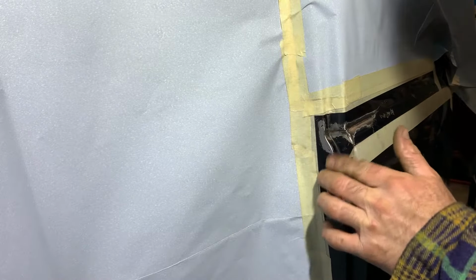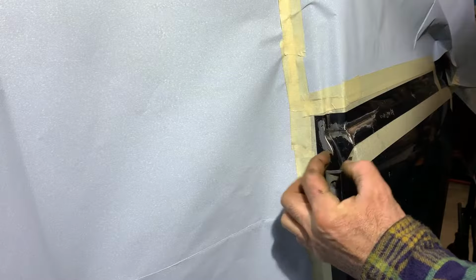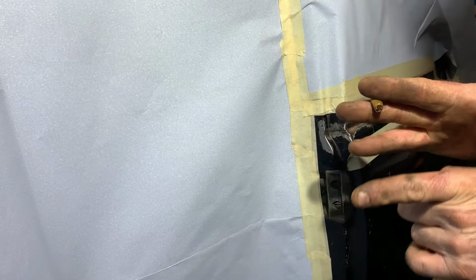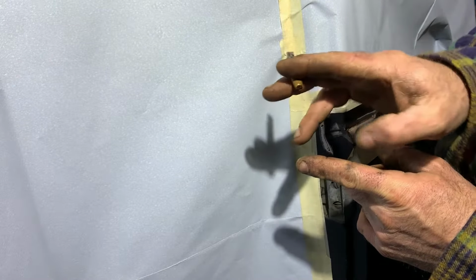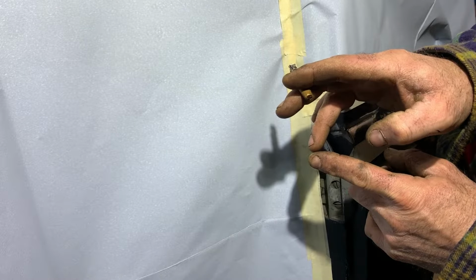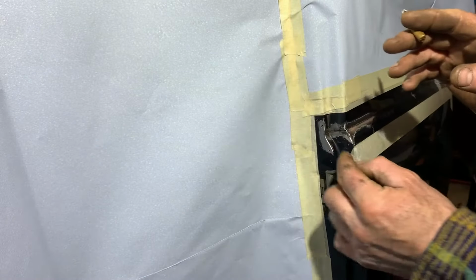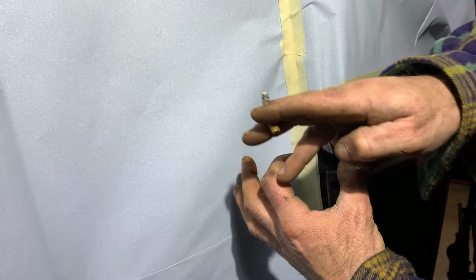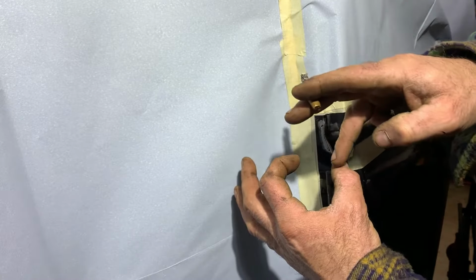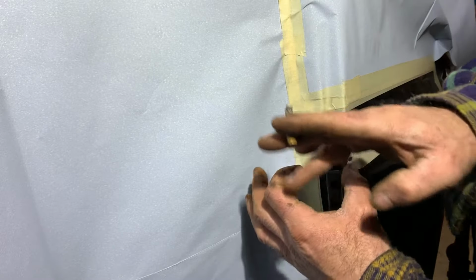Now you're asking why I'm drilling those holes. Well, if you have a crack and it comes to that round circle, and you just have two pieces of metal and it's cracking here, it wants to go further. So if you just weld that, and you have just one spot missed, then it will crack again. So if you drill a hole at the end of the crack, it cannot go any further because it's a circle. It cannot push to one side there or there, it has to be straight, so you break that line. Therefore I drill holes in it.